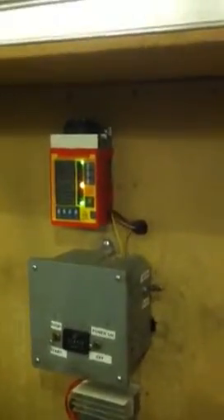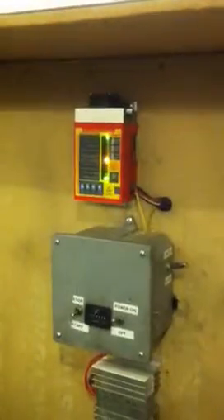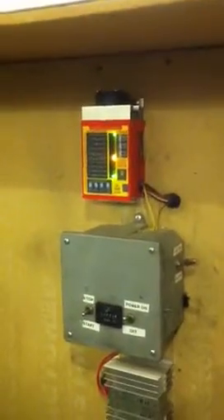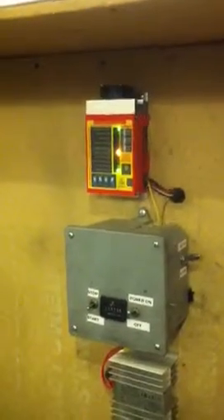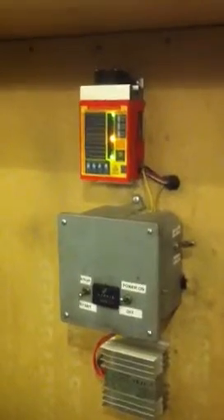It's running right now — that's the noise you hear. I also put in a heat exchanger. We don't have a radiator per se on this. The coolant runs through the heat exchanger, and the radiant floor supply tubes also run through it, so this is what heats the floor in wintertime. That works great for us because in winter we don't get much sun, so the solar panels don't do much work, and we don't get a lot of wind either. We run the generator to generate heat and charge the batteries at the same time.